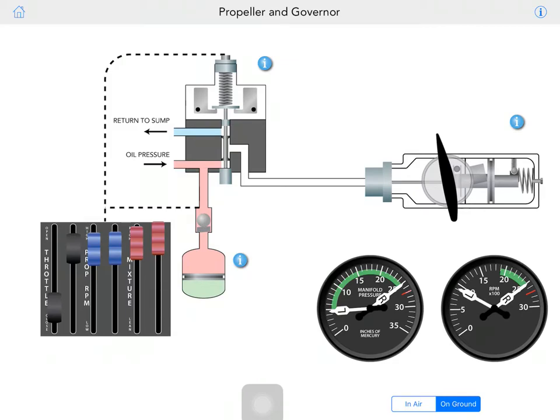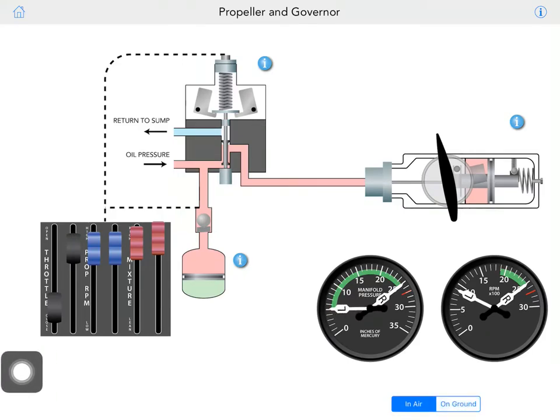Alright, there we go. So your manifold pressure falls below 750 and then your RPM goes below 900. If it goes below 900 and your manifold is below 750 and you're trying to bring the propeller lever all the way down, that's when the pin falls into place and locks it up. So yeah, get it out of that.